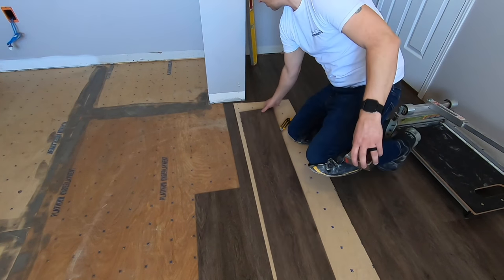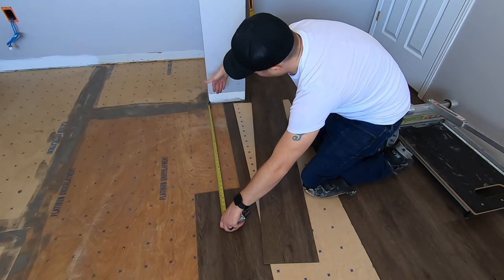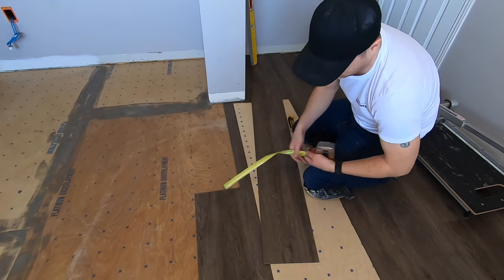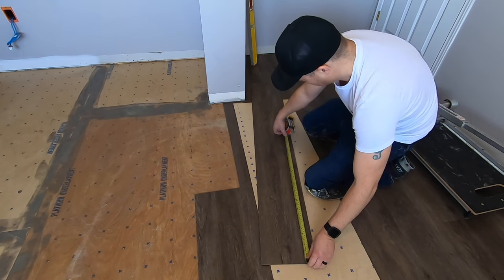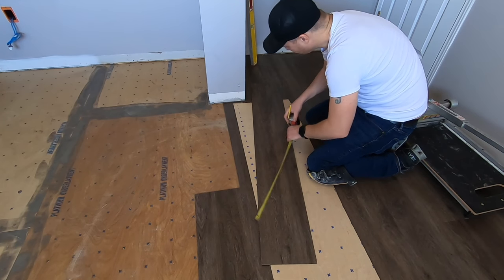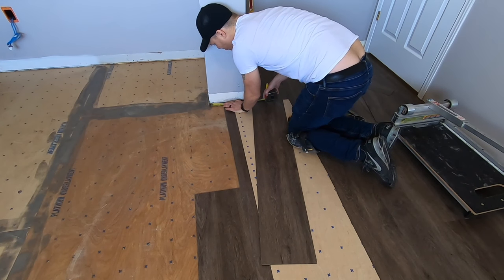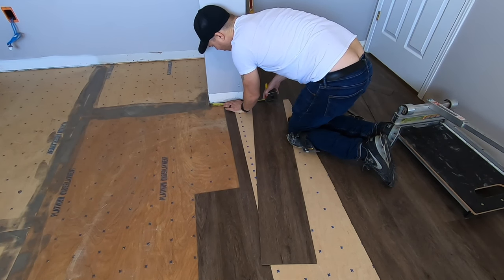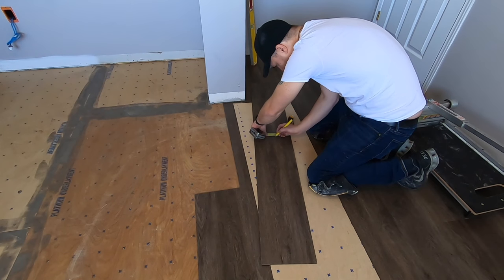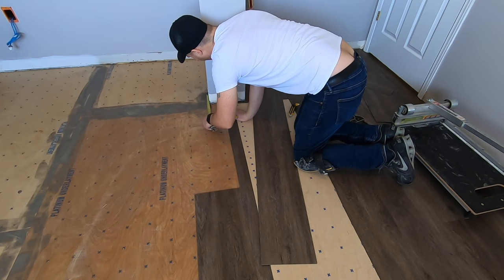Another tricky one. This one just gets a notch. So I measure off the corner bead because the corner bead will be kind of kicked out from the drywall. So we got 30 and 8, so I'll do just over 30. Okay, and this way is, stupid French tape measure, 3 3/4. Whole thing is 4 7/8.